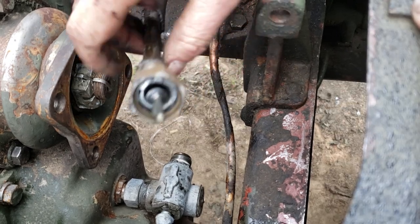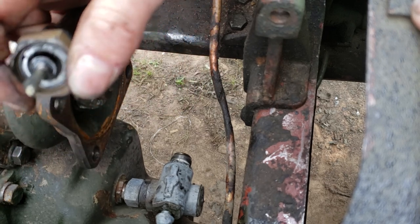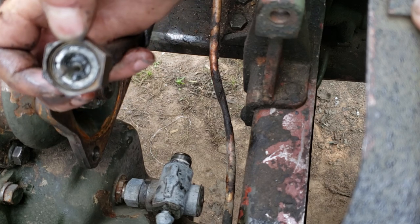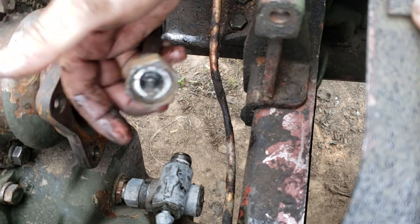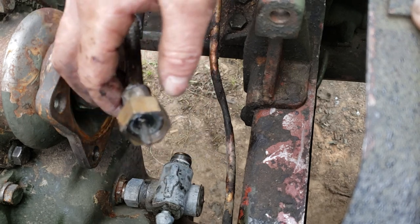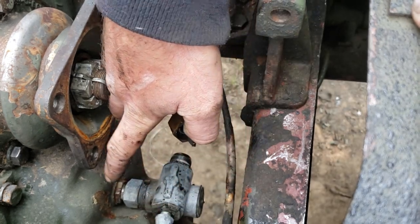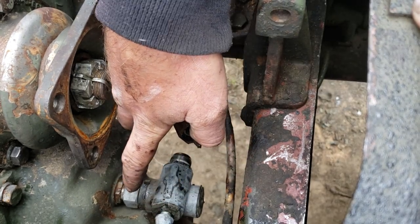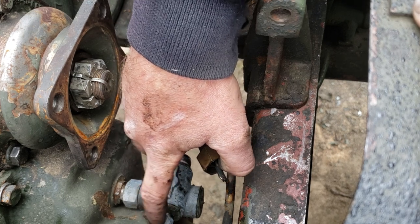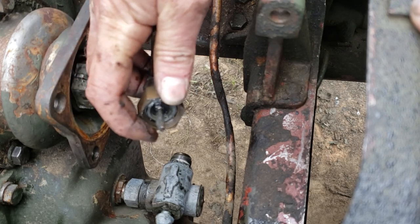No. Just metal in there. And see, I've already replaced this center drive once because it broke. And you see it's got a bunch of grease in there that has come out of here. And that's part of the feature of it, okay? The cable is supposed to be self-lubricating. I say self-lubricating, it doesn't lubricate itself, obviously, but it's supposed to take the grease from here and actually pull it up the cable itself and keep the cable lubricated.